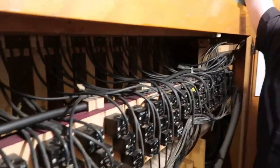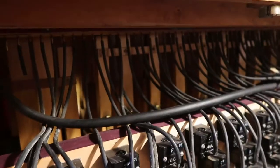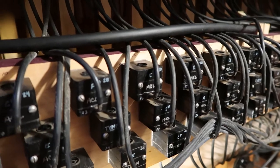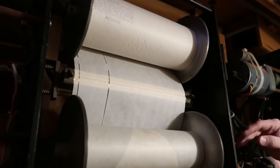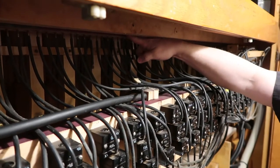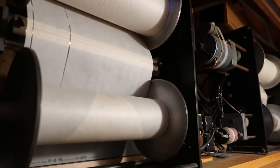Okay. So what you just got was vacuum only. That's so cool. So what are all of these then? So these are vacuum valves. There's a vacuum pump and it sucks air through the perforations in the paper. Both of these, we call these tracker bars. They're connected to a stack here. So each one goes to a common channel here. And there is a pneumatic system inside that shifts one way or the other. And that either pressurizes this one or that one.